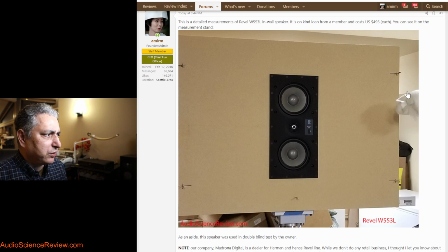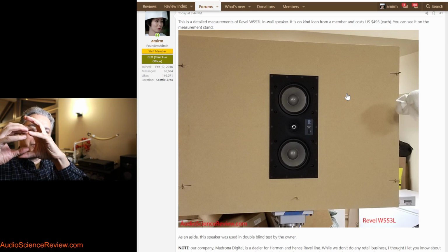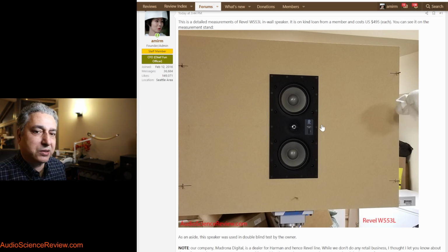Anyway, the way the Klippel near-field scanner works in this mode is that it will take the speaker and make a circular scan around the speaker's front. So it will scan a hemisphere around the speaker centered around the tweeter. And then it will make a secondary one a little bit outside of that. And using those two hemispheric scans, it's able to detect if the sound is moving out in this direction or is coming back from the other way based on its timing.